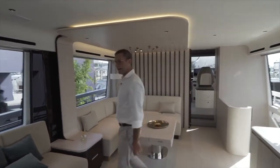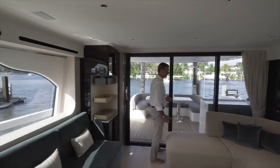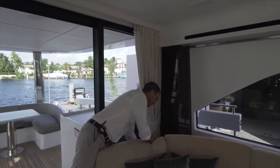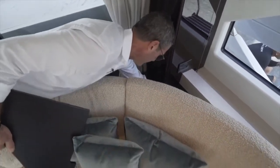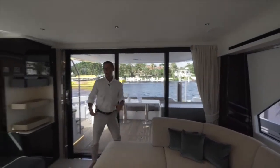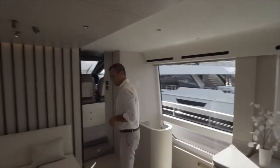And actually, on the technical side, I always like to show, for instance, we always talk about air conditioning, which is extremely important because it's one of the most sophisticated systems on board. It is the air we breathe when we are on board, it is the comfort we have. So the air conditioning is very important, and we provide super easy maintenance access. For instance, this fan coil of this area, you just remove this piece of wood and you access your filter, which is right here, and you take it off with one gesture, take it off, clean it. I always recommend cleaning your air conditioning filter and your air conditioning strainers, and then you put back this panel and off you go. So all the air conditioning systems, we'll take a look at a few, are extremely easy to access so that you can maintain them easily.